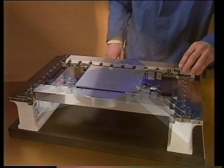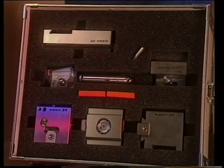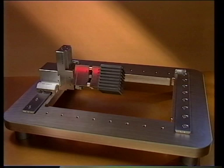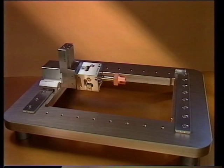For round as well as square workpieces in machines with an L-shaped table, the System 3R three-point attachment makes provisions for full adjustment. System 3R offers a 3D kit for three-dimensional machining of more complicated shapes. These accessories allow swiveling and height adjustment of the workpiece to within thousandths of a millimeter. This kit is an excellent help, for example, for electrode manufacturing in EDMing with System 3R macro or mini systems. The accessories can of course be preset outside the machine, all in accordance with 1 minute setup.